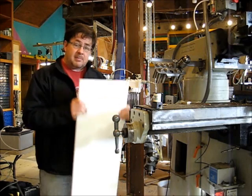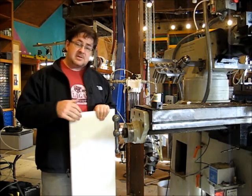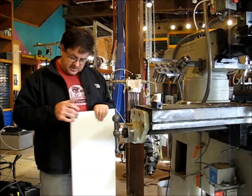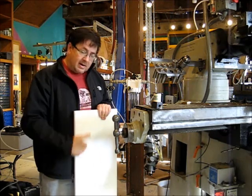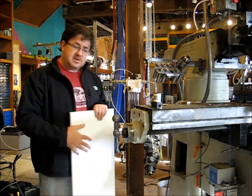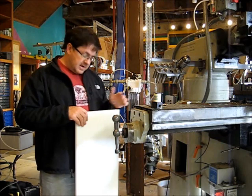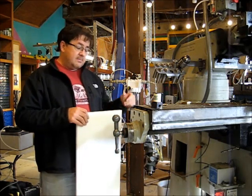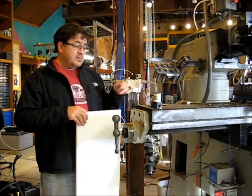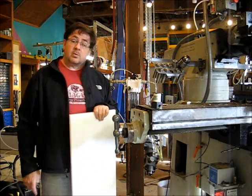I've decided I want to do something like that. So I bought this big piece of polyethylene — we're going to cut it in half, make a block, make a piece for each side of the mill. Then I'm going to take it across the street to my friend's CNC router, route it out, make some grooves for tooling, and make some holes to allow coolant to drain into the ends of the table. I've been using rubber here and it's far from ideal — it's hard to clean and hard to sweep chips off of. I want something with a smoother finish.